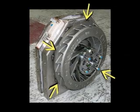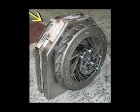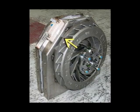Then we repeat the same steps in each of the four corners of the retarder for the front side and average the numbers together. Then repeat the same steps for the rear side and average the rear side numbers together. This will tell us the average air gap of the front and back of the retarder, and we can compare this number to the spec of our retarder.